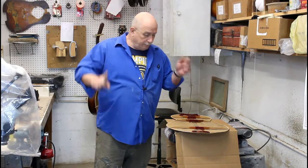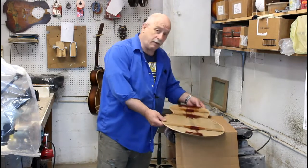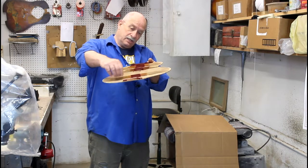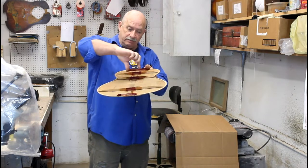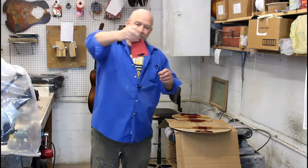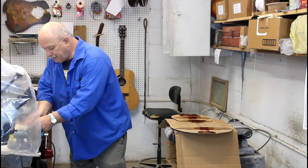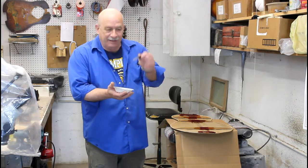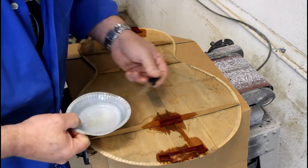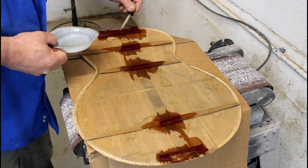Job number two is this Gibson guitar here. I still need to figure out some issues, one of which is I need to re-glue the braces in the back that we have taken off the guitar. The braces are already unglued except for just about an inch and a half up the center strip. So I've devised this method — I've taken some t-shirt material, cut it into the proper shapes, draped them over this bad joint, and I have a little tray of water and an eyedropper, and I'm going to drip water onto the t-shirt and let that soak in, hopefully loosen that joint so those things can be taken apart and put back together.